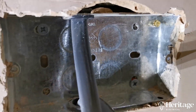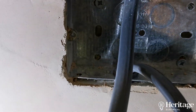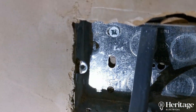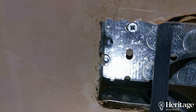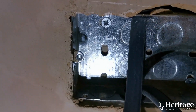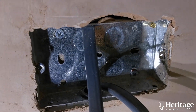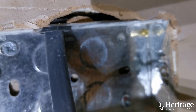You can bond the back box. There is a loophole that says you can probably get away with not bonding it if you've got a fixed lug, which you have here — so most back boxes have a fixed lug, so you can get away with not bonding it. But it is better practice to bond it, especially if there's any metalwork and there's a connection there to do it.